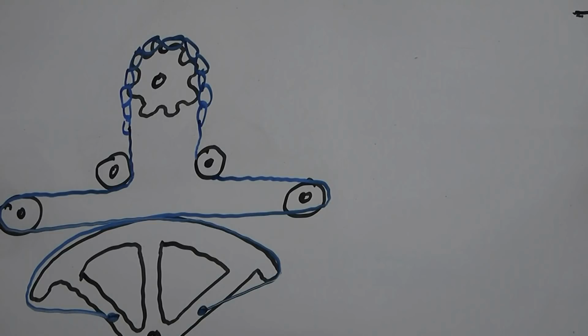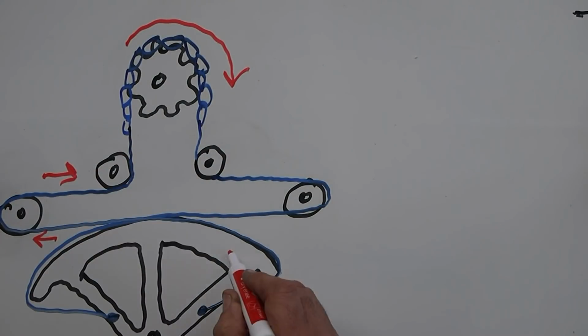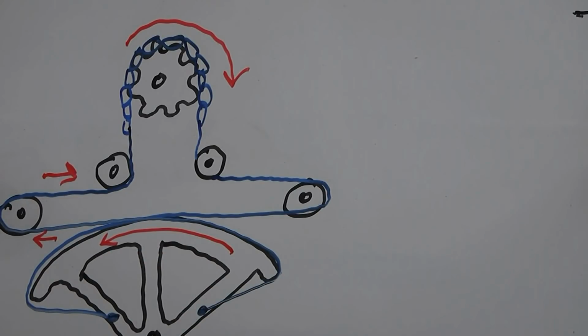Note that the cable traverses the whole groove of the quadrant and is attached on the far side. That way each cable is always riding on the very circumference of the quadrant as it turns. So now if we turn the wheel to the right, it pulls on the left side cable, turning the quadrant to the left and the rudder to the right, and we turn right.